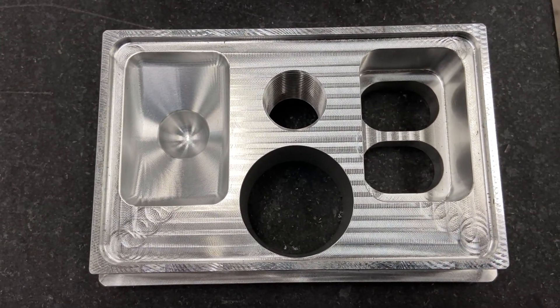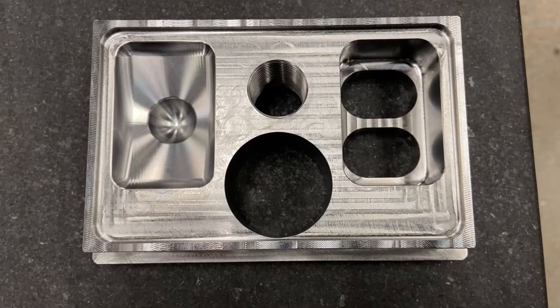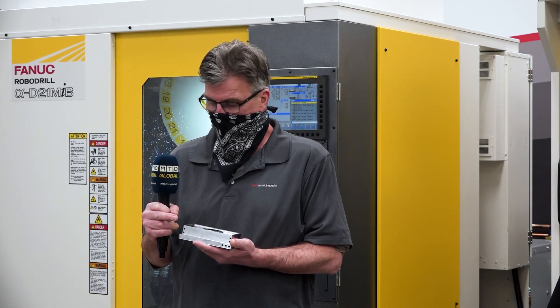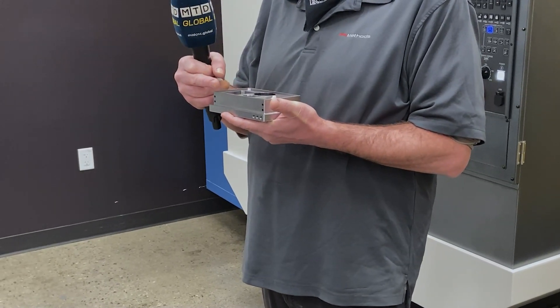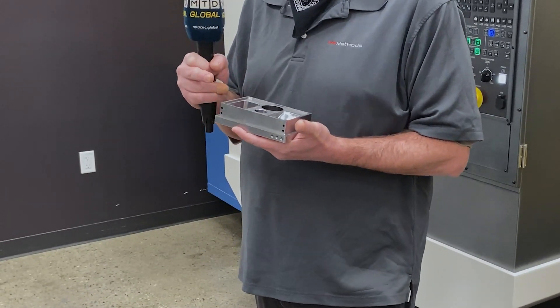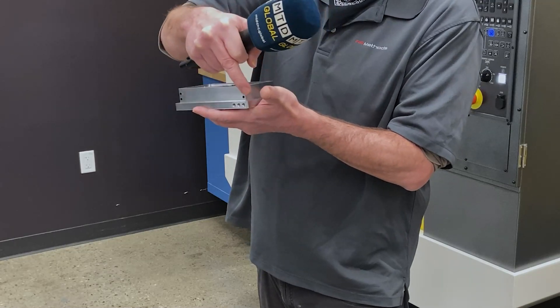With the dynamic milling we're doing with the steel, it's pretty close. So Bill, let's discuss a little bit more about this part that you're machining. We talked about it being steel versus aluminum on a robo-drill, but can you show us some of the places that might be more difficult and some of the strategies for programming a steel part on a robo-drill? So we start with a face mill, dry cutting, no coolant, no air. It's cutting 100 thou deep, and it's about 60% of the cutter width, and it mills off 100 thou to rough it. Then it comes in with the end mills using dynamic milling, dry, no air — dynamic milling to do the outside and the step on the outside.